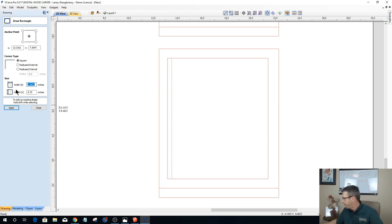Right now, let me grab these plates again. I've got a part here that's got a little bit of a dado in it for something completely different. But that slot right here, that dado, actually it's running with the grain, that groove is a half inch wide. Now it's not all the way through, so I can't really show this, but if I have that half inch wide, my plates are going to sit down into the groove until it meets both ends, which is fine. I want that. That gives it more stability. I do not want these plates to ever break.